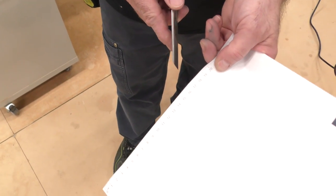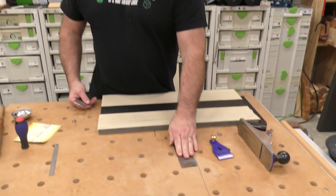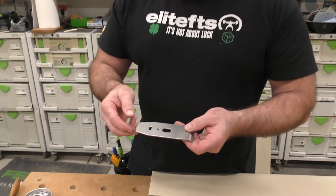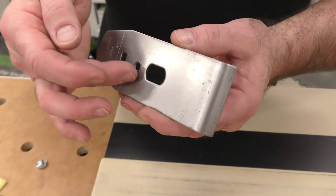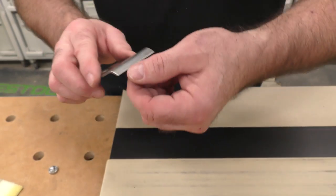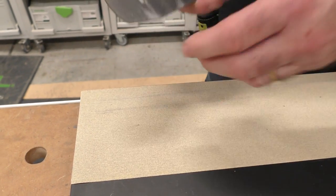The next thing we're going to work on is the chip breaker. When I first started inspecting this, there's no refinement on it — this burr is holding it away, and there's another burr here where the threads are. I'm going to file those. Right here, this front edge has to mate perfectly to break the chips that come off. I'm going to do some polishing and refine this. Look how it's sitting proud — I'll take it to the abrasive and do both burrs simultaneously. Those are almost off... those are flush.